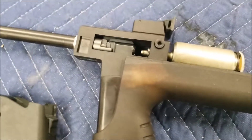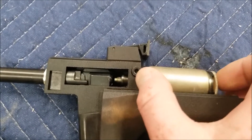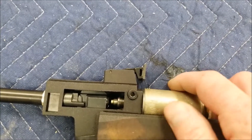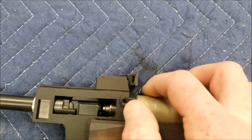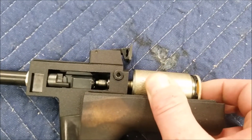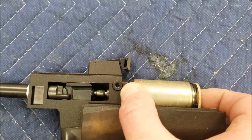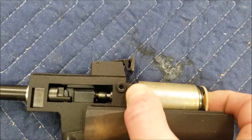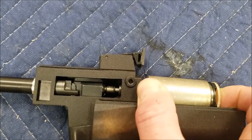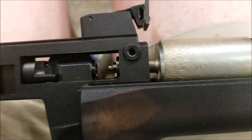This is the part that confuses people the most. Your whole assembly — meaning your collar, your plunger, and your solenoid — can move forward freely. Your plunger can also move independently. To fully adjust for maximum power, you want that plunger on the valve. Push it in and then see how far the whole assembly goes forward when you press on the entire assembly.